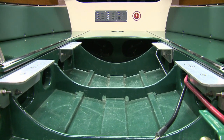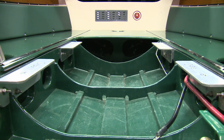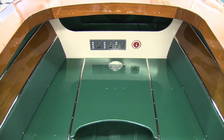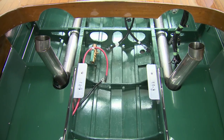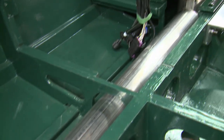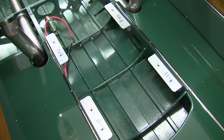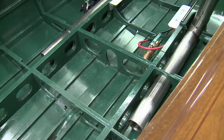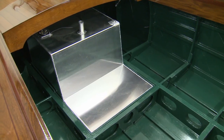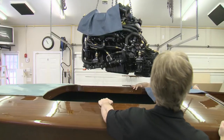While I've been back at the studio, Richard continued fabricating and installing the electrical and mechanical items required before installing the engine. At the bow, the 12-volt electrical panel was installed along with the wiring. The battery switch and cables were also now in place. The first sections of the twin stainless steel exhaust had been fabricated and set in place, the engine mounts had been located on the stringers, the bronze water intake and seacock was installed, and at the transom the custom fuel tank and stainless steel fuel lines were installed.